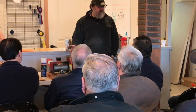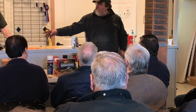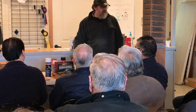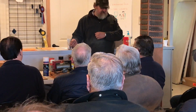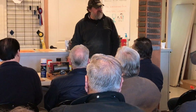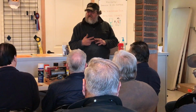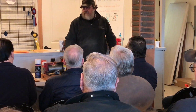Headless, you can't get in there to beat on it, so I took a piece of channel about 4 feet long, made a bracket to fit on the back of the rod with an eye bolt, and hooked a come-along to it on this channel. I'd go out there with the come-along, get one click, put the air to it, let it sit. Took the weed burner, heat around the cylinder, a couple days later, get another click. I had so much tension on that come-along that I was pulling the cable through the wrap on it.